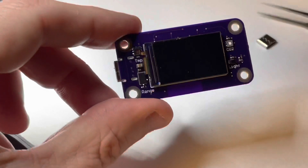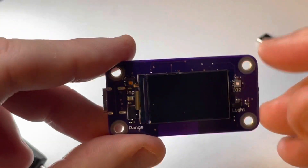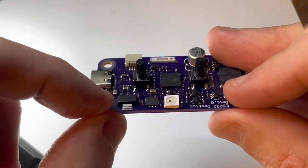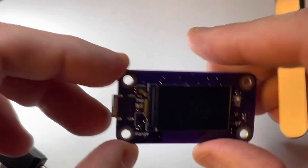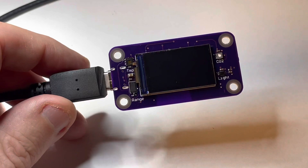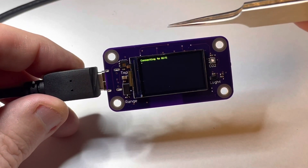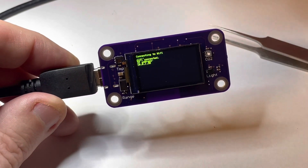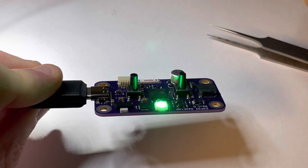The other thing I would probably do is get rid of the onboard temperature humidity sensor, because the 3.3V LDO is right on the opposite side of the sensor — that's why the temperature reads so high. I'd possibly move the temperature sensor off the board, tethered via a cable to the top, side, or bottom of the enclosure.